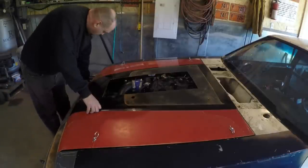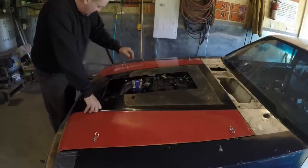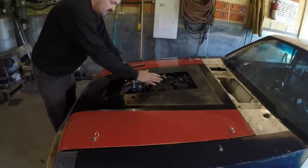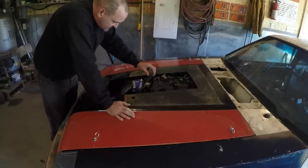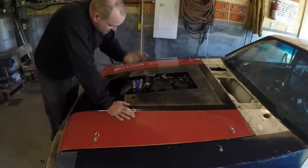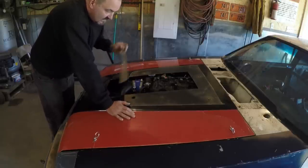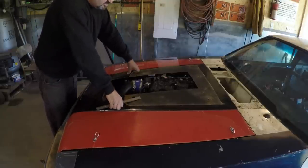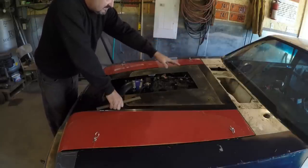He has plans in the future to do an upgrade on the intake and put a larger intake on it. After doing some measurements, we realized that the intake he's decided to go with is going to be about 12 inches high from this point here. So I'm going to make the hood roughly about this high, so it gives it room to grow to be able to put a larger intake on it. Now, eventually I'm going to be cutting all this off the hood, but for now I'm leaving it all there for the structural strength, because one thing I've noticed in the past is when you start cutting the back out of the hood, everything starts to fall.